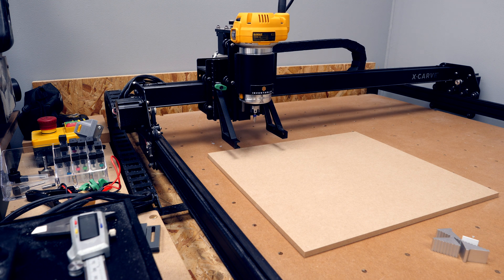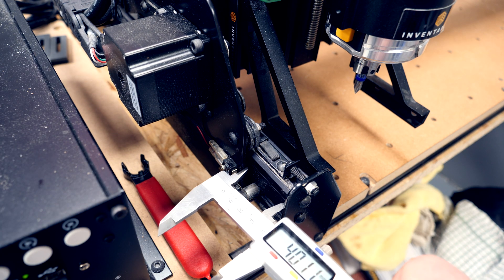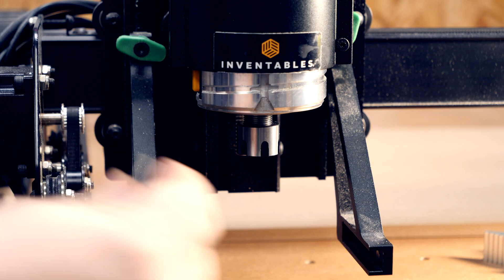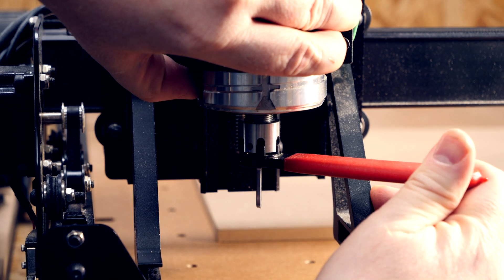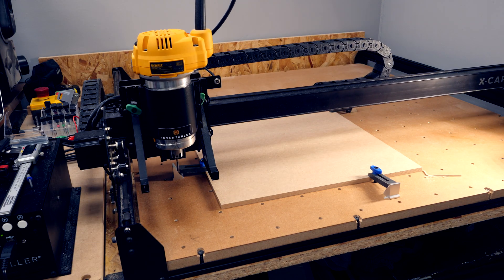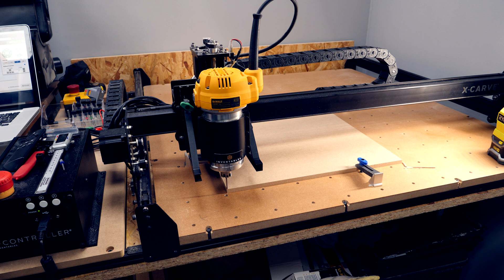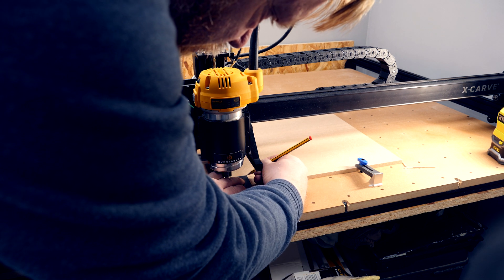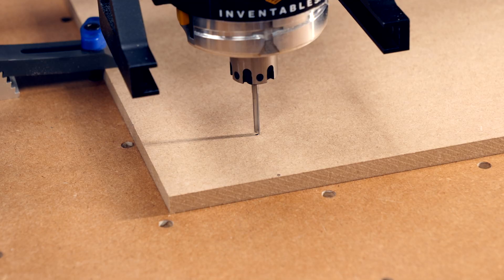Let's home the machine and swap out the bit I have for a 1/8th inch straight cutting bit. You can see here that I've upgraded the nut and collet to the Precision Collet. Clamping the material down to the wasteboard is pretty simple, but it's important it's firmly clamped down. I need to position the cutter at the zero point on the material. The artwork is centered on a 300 by 300mm square in Easel and I'm measuring to center that square onto the material. If I don't get it quite right — and as I've cut the board over size — I can come back and trim it down with the track saw later.